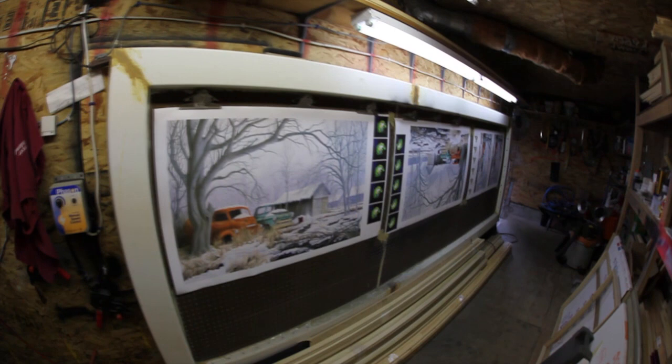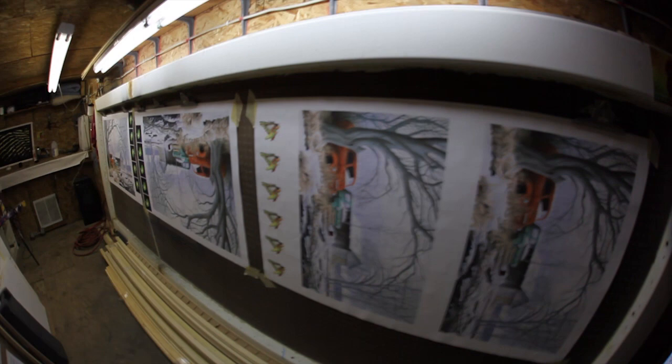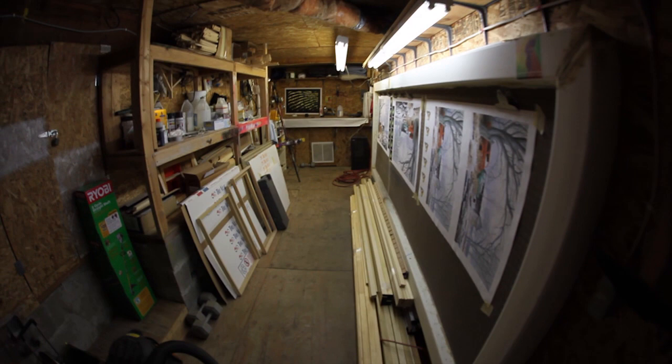In a nutshell, here's what we used to build the spray booth: six inch square plastic fence posts, some plywood and one-by-two wood for the channels, a 4,500 CFM variable speed controlled fan, and a variable speed controller.